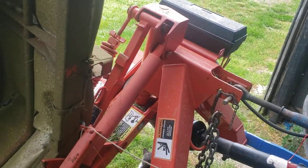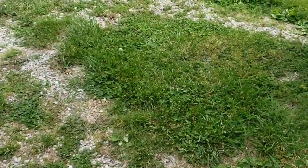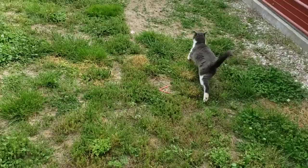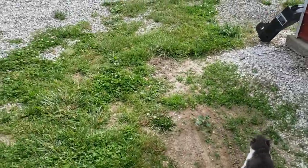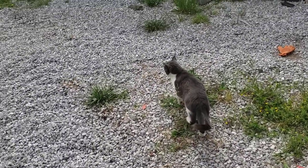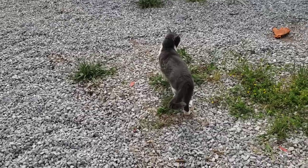I don't know when I'm going to be raking yet. I've got the double rake system with a dolly and everything, but the problem is his gates are so narrow that I can't even get the dolly through there without the rakes. And one spot where there's a crossover to another field through a wooded area, I had to fold the mower up just to get through. So the double rake system isn't going to work — I'm going to have to invest in a V-rake or something this year.